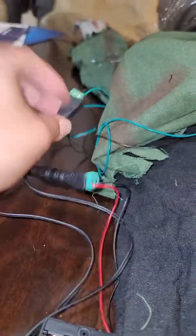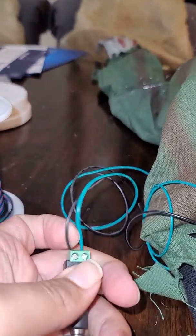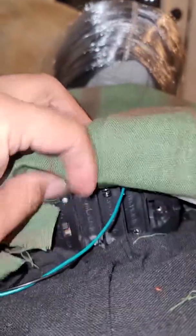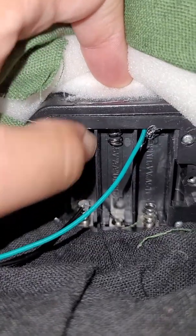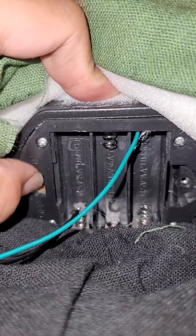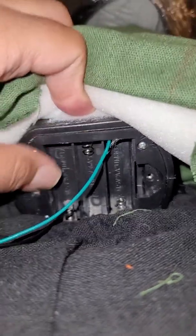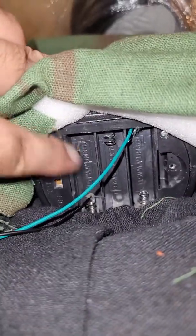The out will then go to your device. Get some wire — you might have some scrap wire. I color code mine: black for negative and any colored wire for the positive. That way I don't get them confused. Then all you have to do is run those wires to the device. The spring side is usually the negative side and the flat side is the positive side. I just touch the wires to the device, turn on the device, turn on the box, and see if it turns on. If that doesn't work, then I try them the other way — they work in an X-type cross pattern.